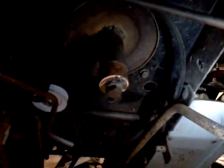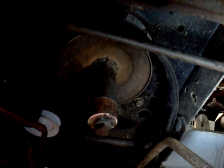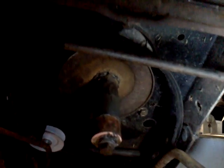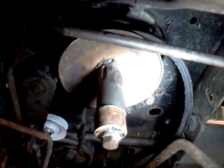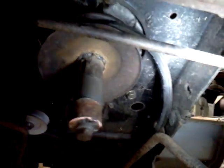Down here, this is what I did. I got the 6 inch that would normally run the cutting deck for the mower. I cut it and reversed it, and it set right on to it. I welded it up — it's all balanced and straight. Now I'm in the process of getting the belt.